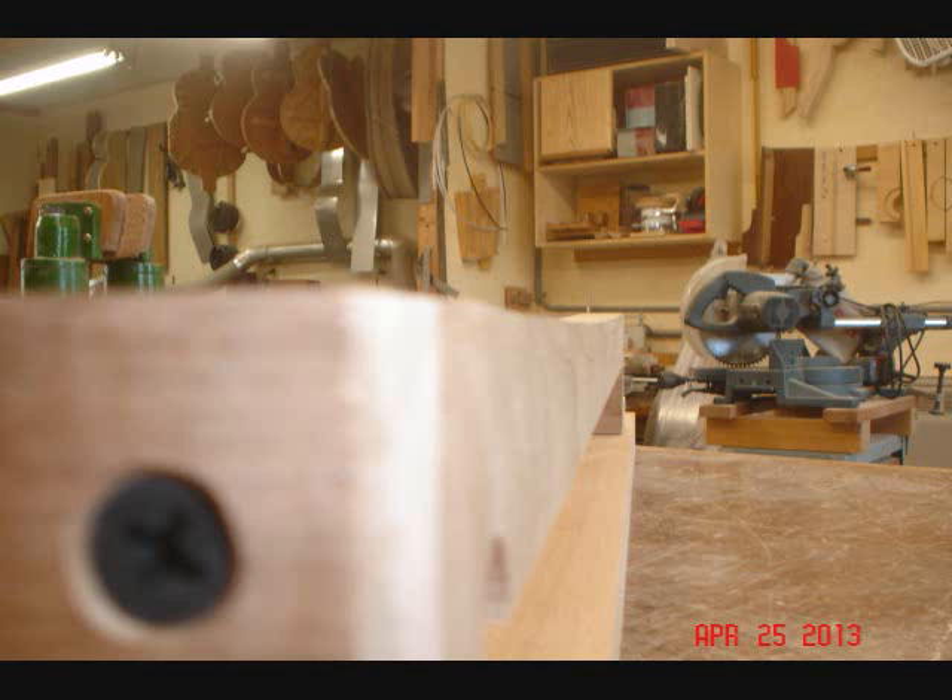In this photo, you can see the arching of that rail system on top of the frame. This was the hardest part of the whole system to make because it needs to be pretty precise. The only way to do this is to saw it out on a bandsaw and then gently sand it to the curvature that I want, to perfect that bandsaw line. It can be quite a chore, but it's made easier by actually making the arch in one piece of wood so that it's very consistent, and then sawing down the center of it, separating it into two exact pieces that come out, obviously, exactly the same.